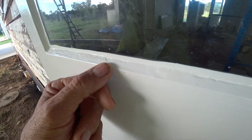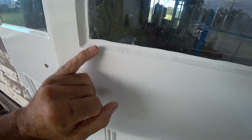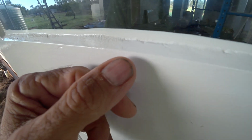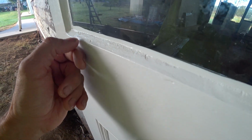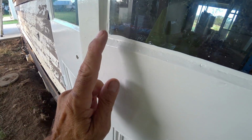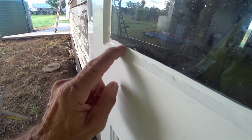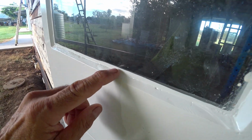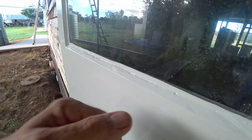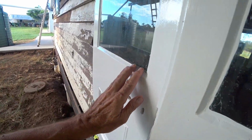Okay, if you can see there, it's good enough to be hidden and to look finished. But until this dries properly, it's always going to do this. This is a wrinkle called crocodiling. Two oil-based over the top of each other that haven't dried. So for us to get rid of that, we wait for a month on this here, seriously a month, and then we just cut that back, a little undercoat and then a little fitch, and then we can fix that.